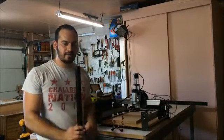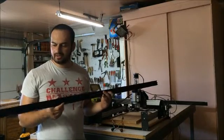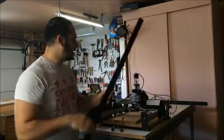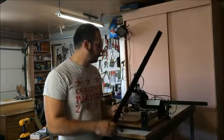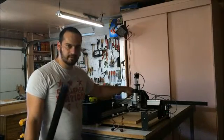I went on OpenBuild and I grabbed three 1.5 meter aluminum extrusions — the V-slots. I got the black anodized ones for surface hardness. I'm going to leave these at 1.5 meters for the longitudinal axis, and then cut one in half and double it up for my horizontal axis, so that will be 0.75 meters.